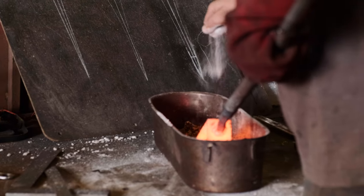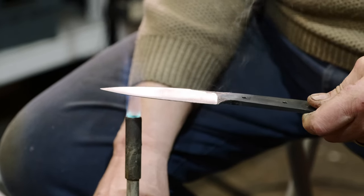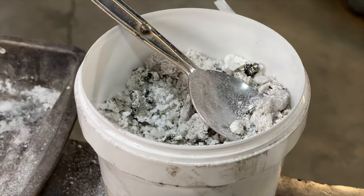There are two ways of keeping your surface clean. One is to put flux on there — you'll see plenty of YouTube videos where people heat it up, sprinkle borax on, then heat to welding temperature and forge it. Bear in mind that as soon as you get above about 200°C on a piece of steel, oxide starts to grow on the surface. That's what tempering colors are — heat a shiny piece of steel with a torch and it'll start to change color at about 200°C, going from straws into purples, blues, grays, then it'll start to glow red. That is the oxide layer on the surface. So you put flux on there; borax is what a lot of people use.